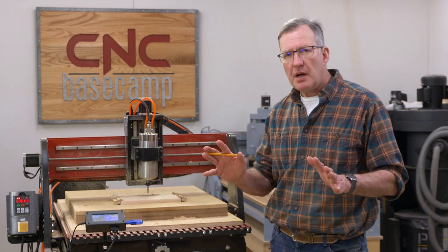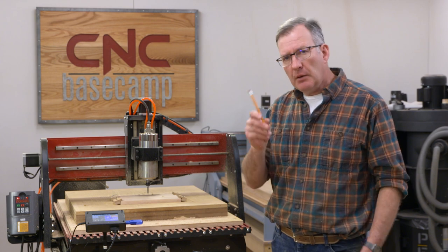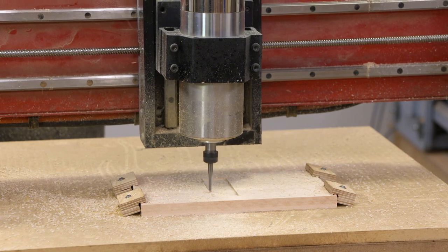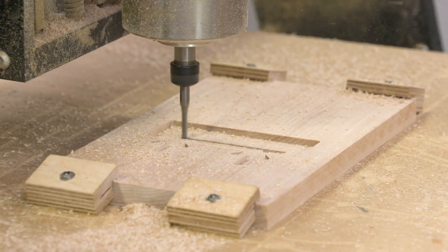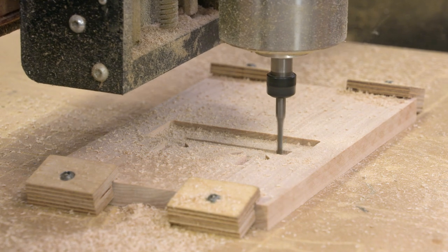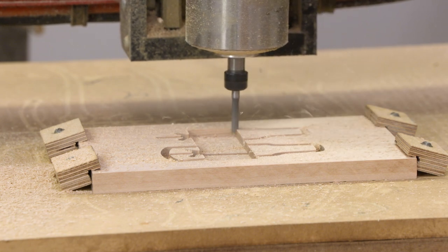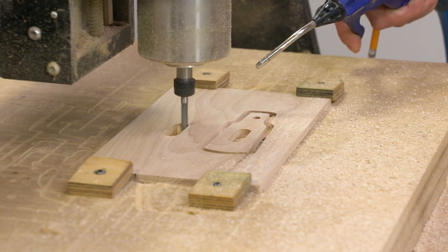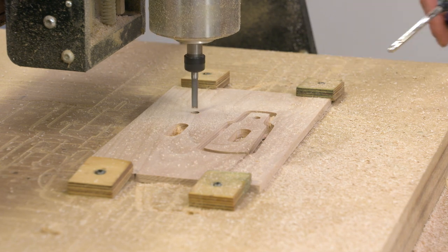Creating the wooden parts of the trammel is very much like the drafting head. We have a back and we have a front. The only real difference is you need two trammels. So we're going to see two parts being cut out here. There'll be a pocket cut, which will create the seat for the ruler to lay in, and also the area for which we have the little brass U and the inserts and so forth. Then it's going to cut the profile. When we do the thin top plate, you're going to see the machine cut a viewport, a hole for holding a pencil or steel point, and then the profile.